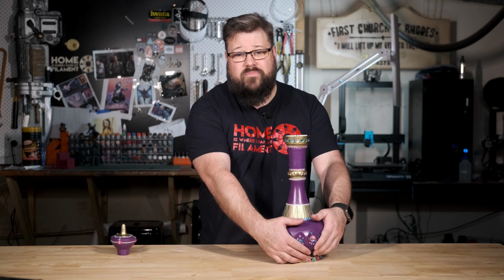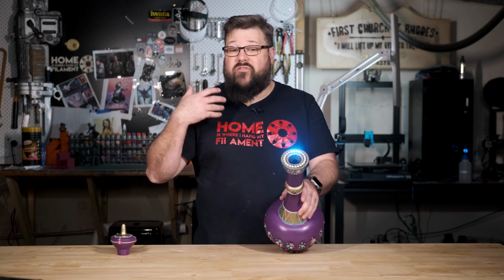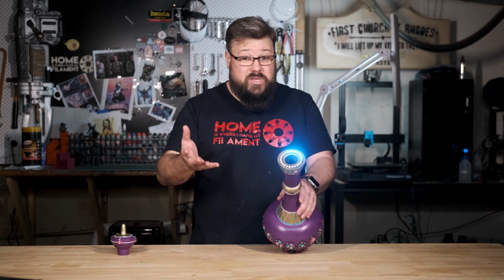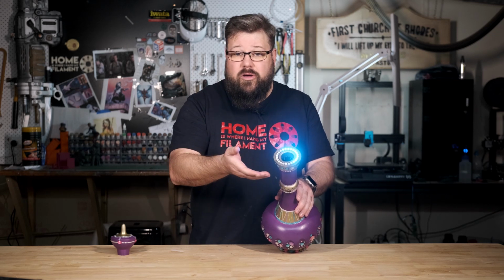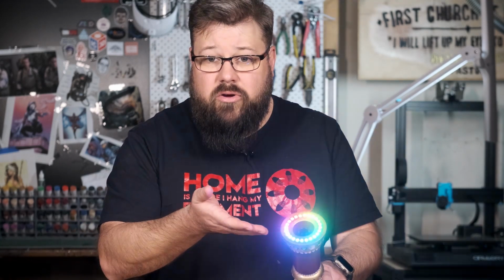And the bottom button will trigger a 30-second countdown before firing rainbow lit smoke for about 10 seconds. To give Lucy an idea of how long is left on the bottom button timer, you can see that the top Neopixel ring is displaying a rudimentary visual countdown. All of this is controlled by the Arduino, so the light color, the duration, and the countdown are easily customizable. When the countdown is up, it fires smoke.